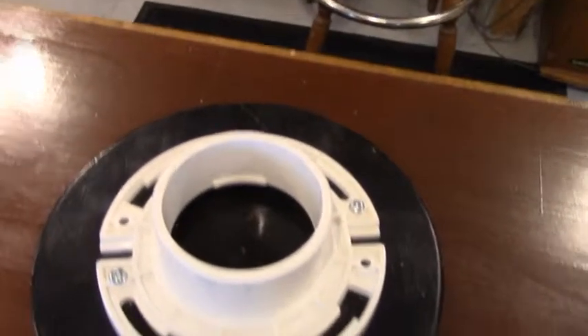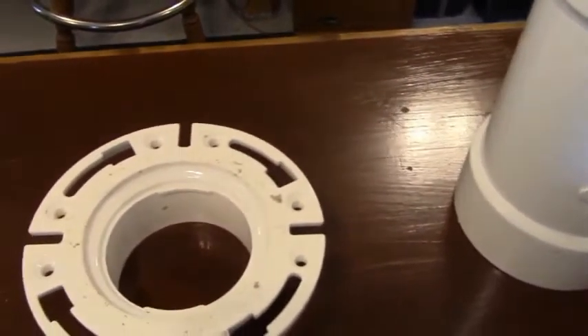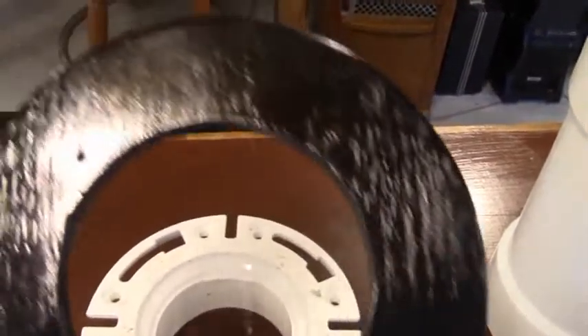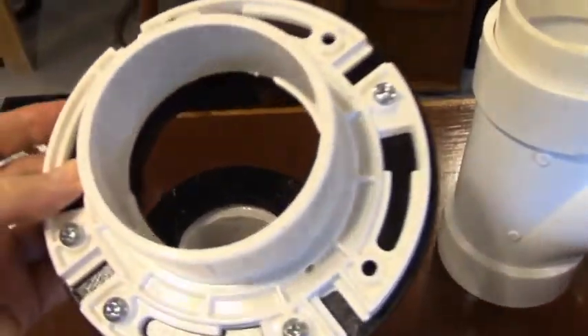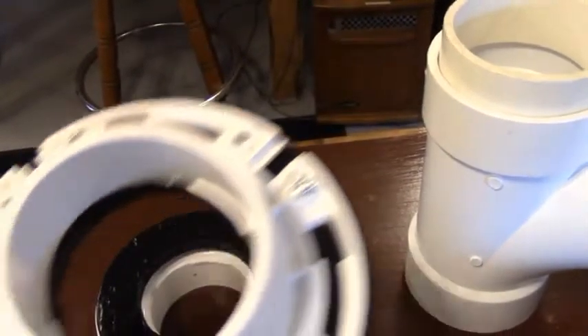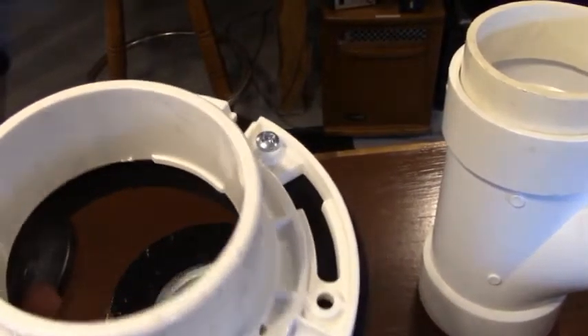Here's a typical base again, made from a four-inch closet flange mounted on a piece of three-quarter or half-inch plywood that I've rounded the ends off and painted black. Here's another shot of the flange — you'll have to cut yourself a piece of half-inch plywood about seven and a half inches in diameter and about a little over four inches across the front. It will be bolted to the top of the flange — I've got one already done that you can look at, nice and tight inside the flange ready to go.